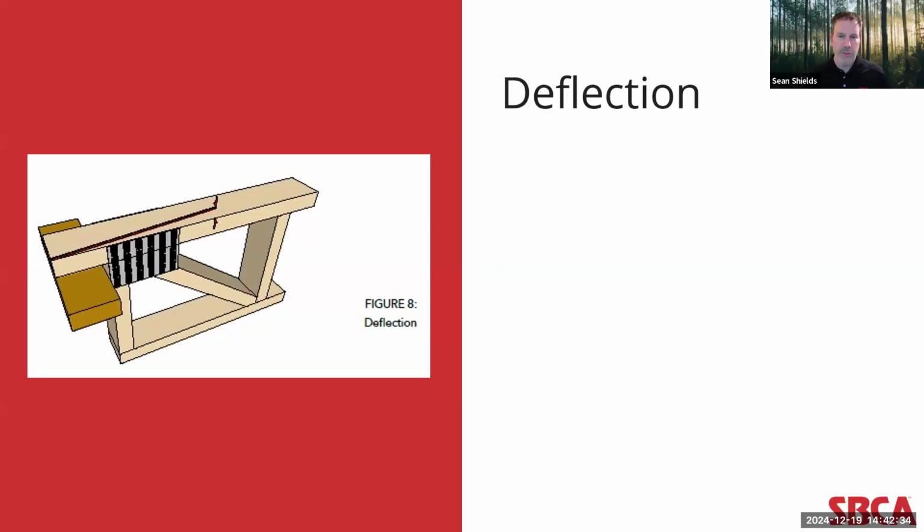So under the 2022 standard, the truss is also going to be evaluated to prevent undesirable deflection in the extended chord region. So even if the joint design satisfies all the other strength checks, localized deflection of the joint may render it unsuitable for use. So this is an important sort of last check. This design check imposes limitations on deflection, including that due to the extended chord.